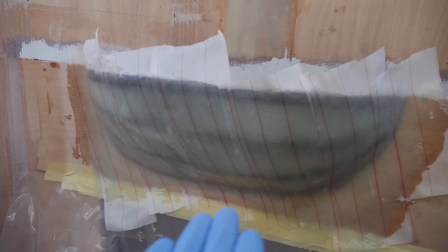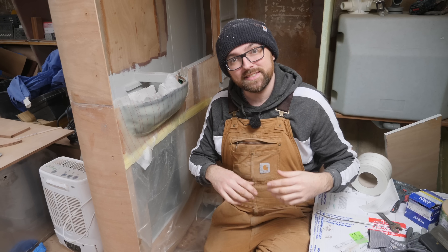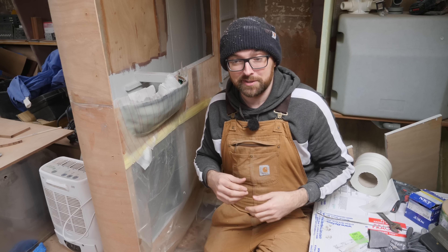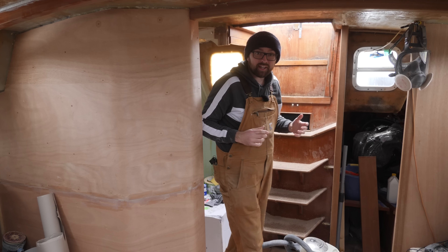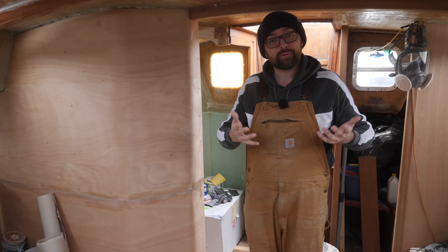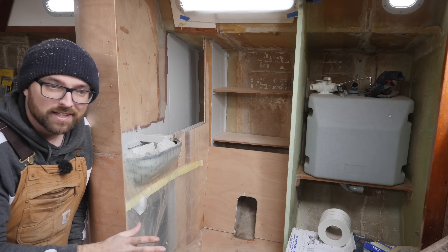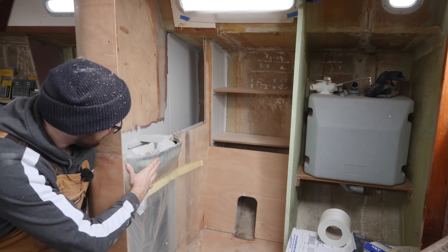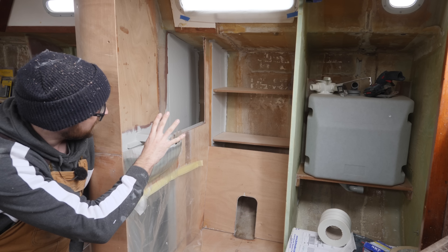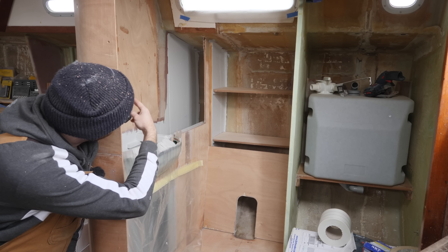About a day's worth of fairing and this should look like something off of a race car. The reason I want to remove the plywood skeleton inside of the sink cover is that if I have something in there that's going to provide rigidity I want it to be something that's not going to rot and leave you with a floppy sink cover. Unfortunately I'm going to have to wait until tomorrow to see how strong the sink cover is going to be with that fiberglass on there, and you guys are even worse off because you guys are going to have to wait until next week. I think I made some decent progress here in the head this week — the vanity is fully assembled, everything is sealed up, the sink cover is looking very promising, the area behind the sink is all figured out, I've got the shelves up there. So all that needs is a front and a bit of glasswork to secure the shelves, a bit of insulation, and of course then I also need to figure out what to do about the bulkhead up here.